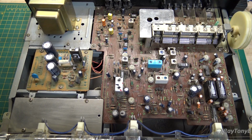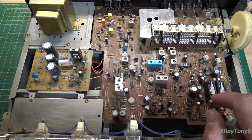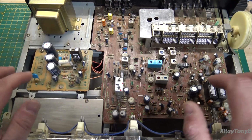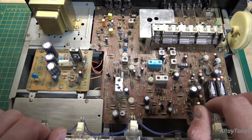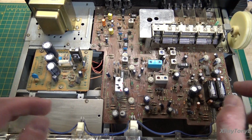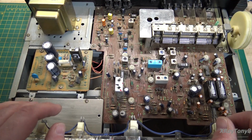So at this point in the game, what I think the best thing to do would be, fix the mechanical problems, repair the tuner knob that's not working, that's loose, replace any burned out lights, clean any of the switches and potentiometers, do a complete recap, verify the power supplies are nice and clean and the right power and so forth, and then go through and do an entire alignment, total alignment of the system.